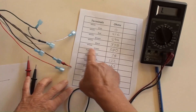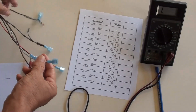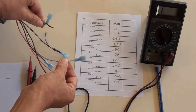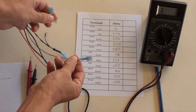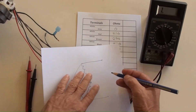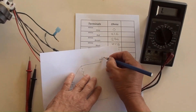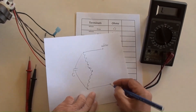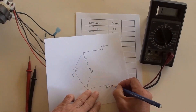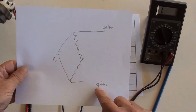Looking into the table, the values progress from 580 ohms up through 680, 780, 880, and up to 980 ohms. The highest value among all wire pair measurements is 980 ohms, which identifies the ends of the two coils where the capacitor must be connected.